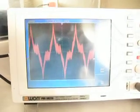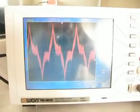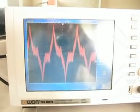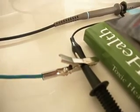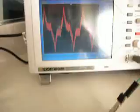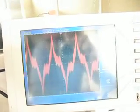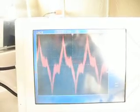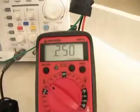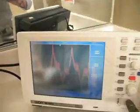And this is what our display shows. The oscilloscope is now running on its own internal power supply with no connection through its grounding system to the AC electrical system. The only ground connection the oscilloscope actually has is to the non-electrified ground probe in the garden. And as we can see, we've got a 60 Hz waveform on our display, and we're set at 200 millivolts per division — so it's about 1.6 volts peak to peak. But our meter doesn't indicate that.